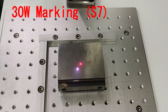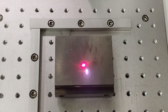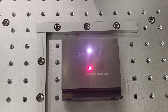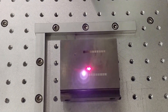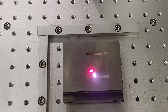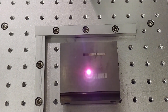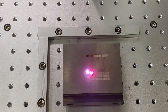Now we have a piece of S7 tool steel, and we're going to mark the exact same grid using the same power and speed settings already set up. The power and speed labels may also be the default pen, so they may show up a little darker. One noticeable difference compared to aluminum is that you get a slight yellowish tinge even after wiping it off. This is just a single crosshatch, so we're not going for depth, but I think marking more than once — multiple passes or multiple crosshatch passes — or lowering the frequency to around 20 kilohertz could get a little more depth.